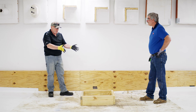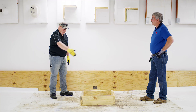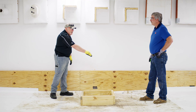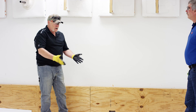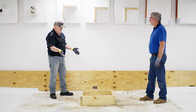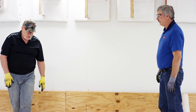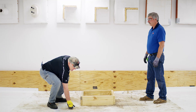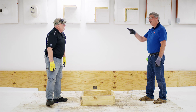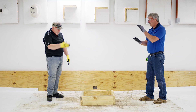What we're going to do here is put a new curb on, as you can see. We've set the curb where we want it to go. We're going to move the curb and cut a square out of here. On this, we happen to be going five by five — a two-by-two curb. Why cut out a five-by-five piece of membrane? Because you're going to take your new membrane and slide it underneath. Very smart, because it's clean on the bottom, basically — a much better chance of welding.